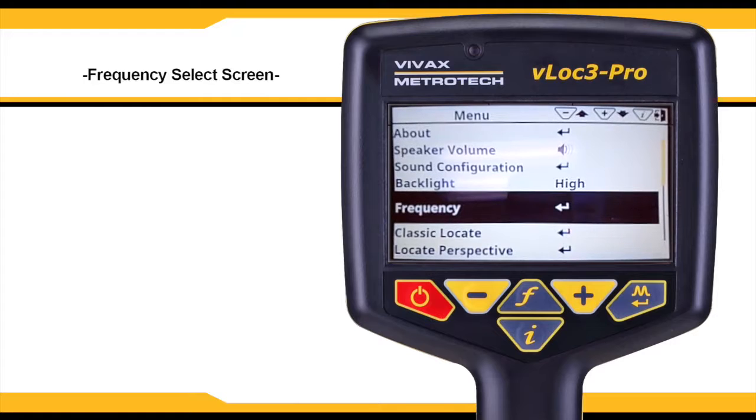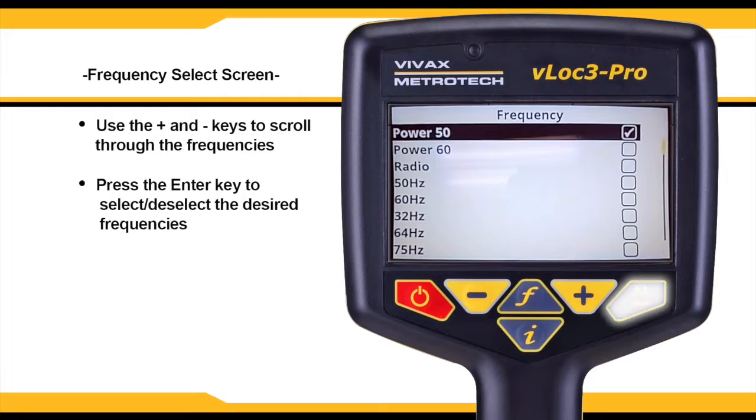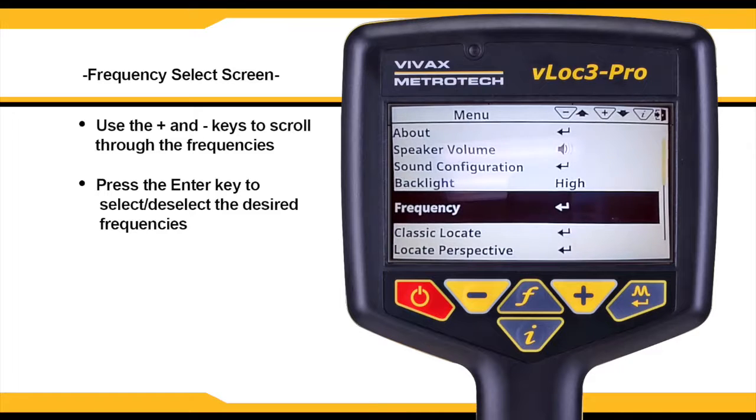The frequency option allows you to select from a range of frequencies. Using the plus and minus keys, scroll through the frequency submenu and use the Enter key to place a check next to the desired frequencies. Once complete, the user will be able to use the selected frequencies from the locate screen.